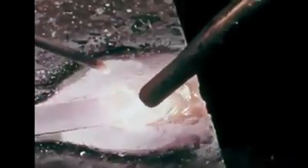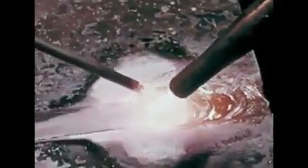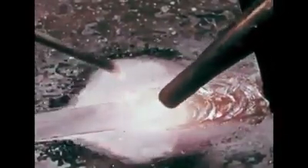Since this is much heavier plate, we will make the weld in two passes. This first pass builds a layer of fused base and rod metal half filling the V. Follow the same welding procedure used in welding steel sheet. Deposit rod metal until the puddle is slightly larger than one-half inch in diameter. Remember to heat both sides of the V evenly, and use the welding rod and the flame to move the puddle along the V. Notice how the sides of the V become molten ahead of the advancing weld puddle. By directing the flame more on the rod than on the puddle, you can prevent the puddle from becoming too fluid and difficult to control. Proper control of the weld puddle comes with practice.